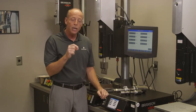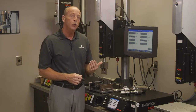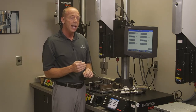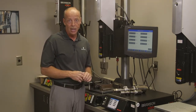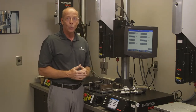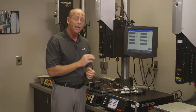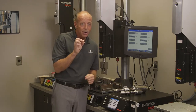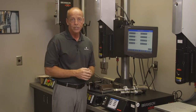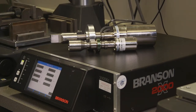The amount it vibrates or displaces each one of those 20,000 cycles per second is called amplitude, and this is adjustable in very fine increments. In a sense, amplitude is the heating potential of ultrasonics. More amplitude, more potential heat can be generated. Less amplitude, of course, less potential heating. The frequency is matched or aligned to the application, where 40 kilohertz is a very finely defined frictional activity for very delicate sealing surfaces. 20 kilohertz is a little more aggressive and can also manage larger seal areas.